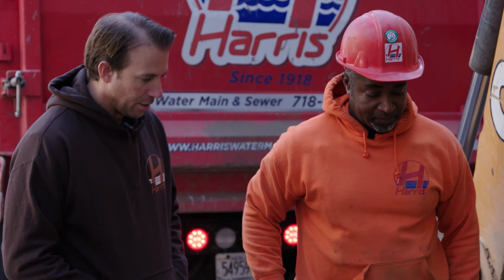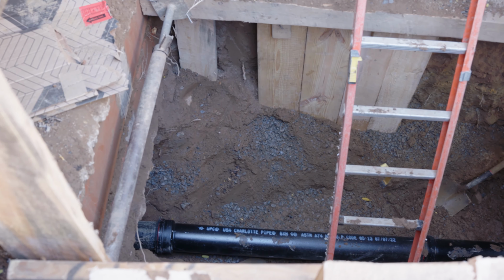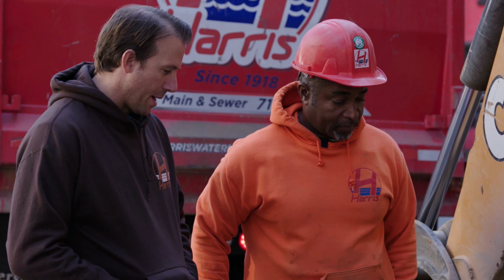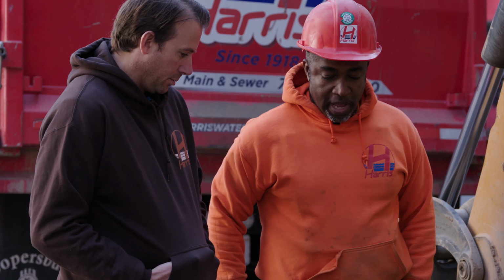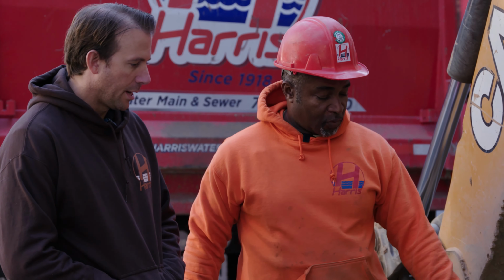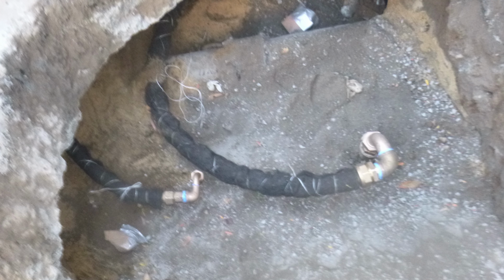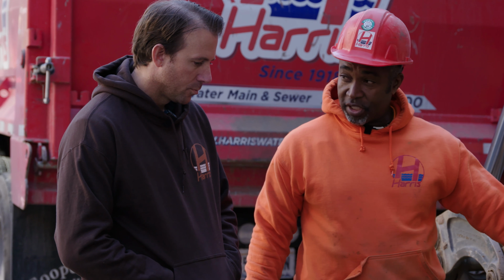So today we got our drilling connection for the sewer. Yes, the sewer is completed. Sewer's in. So at this point now, you're back in backfill? Yeah, I'm going to bring it up to the water main level. We have the 2 taps here. We have the 2-inch tap for the fire service, and 1 inch for the 1.5-inch domestic.